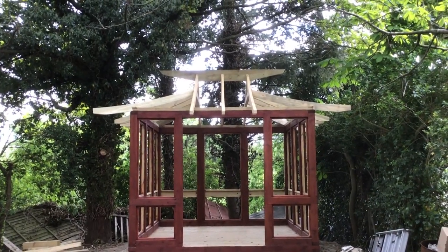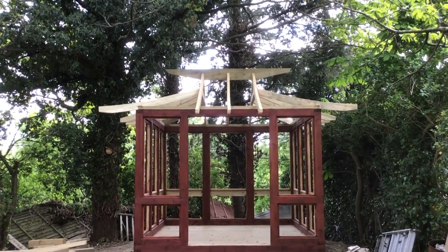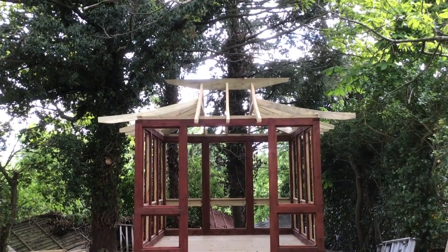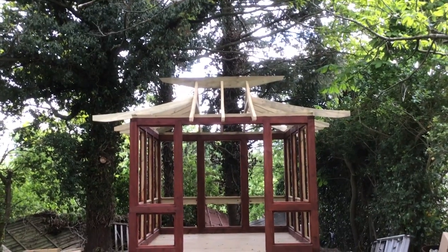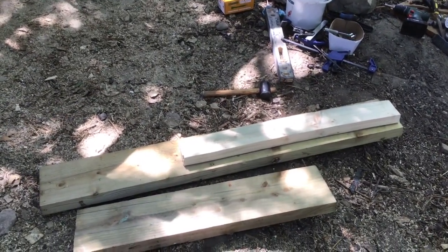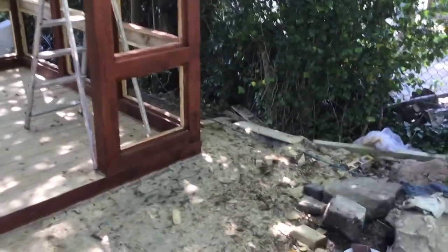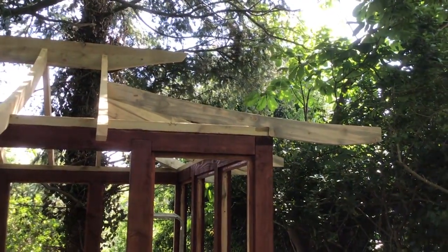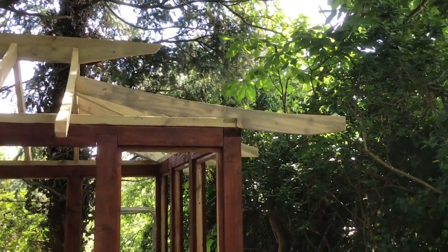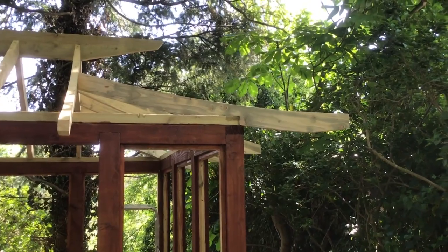The main frame of the roof is now in place. The other ones are just to make the roof frame look quite nice from inside, and on the outside where the drainage system will be fitted. So I've marked out the quadrant rafters — the quarter sections which are the sections at the corner. I'm going to start marking out the little rafters for the quadrants, meaning where the corner rafters go down and little rafters fit either side.